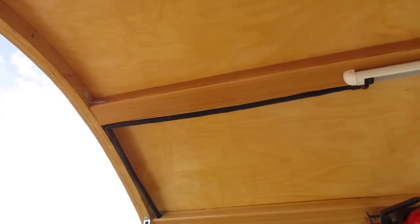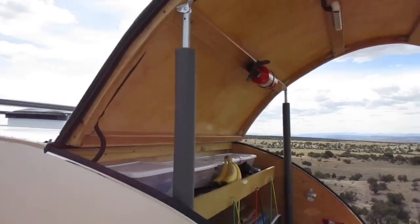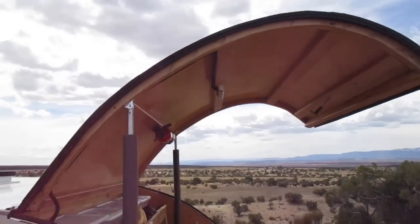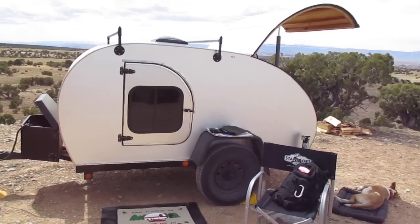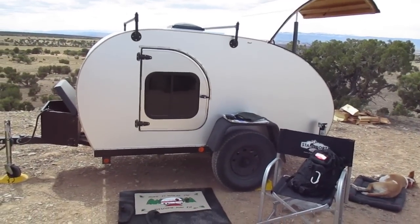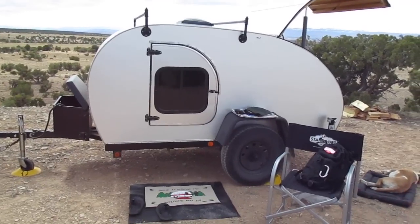The hatch was really tough to build, really tough. I have a simple light right there that goes inside the trailer and then out to the front. I just used some spare plywood to get the layout, the arch, for lack of a better word, the shape of the hatch, and I just laid that on the side of the trailer, traced it out, and that's what became the beginnings of the hatch. It's framed with 2x3s, and I should mention all the spars inside of the trailer, we'll see those later. Those are all 2x3s as well.